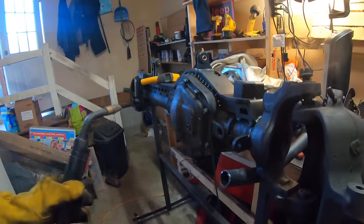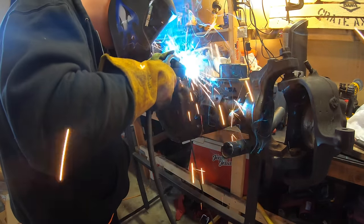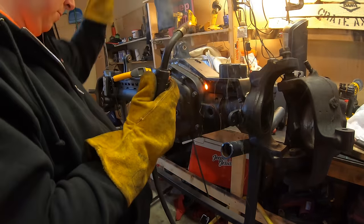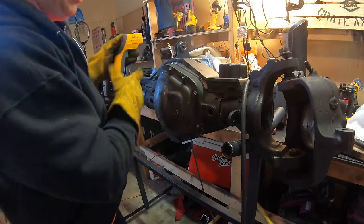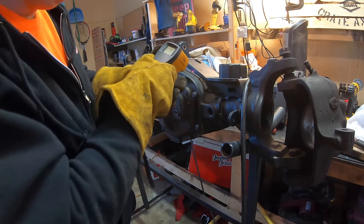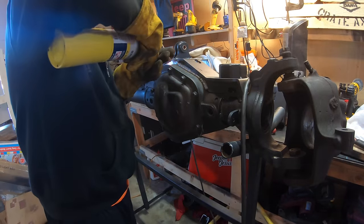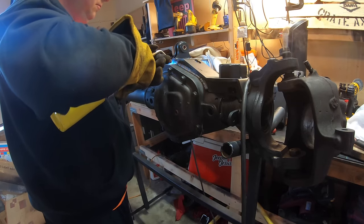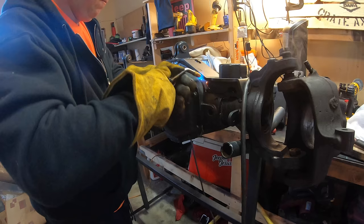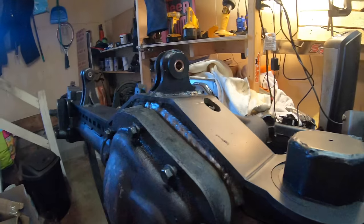While it's still hot we're going to make a weld all the way down — try to do it one continuous weld. Now we'll go ahead and check the temp. Up here on the top where we started, our weld has cooled down to about 412, and the place we just finished our weld is up in the 500s. So we're going to do a blast of heat up here. Since we are filling a gap, you're going to have to do a nice thick weld.